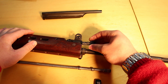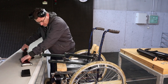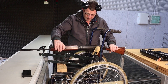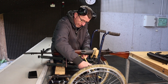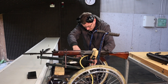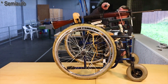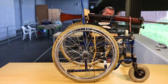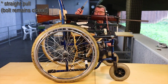The first thing I want to do is measure the velocity at which the gun recoils, in both cases of semi-automatic and manual operation. I asked my friend Guy to help fit the rifle to a rest and tie everything on top of a wheelchair, so that the whole thing can move freely under recoil. This is of course not a properly scientific experiment, but it's going to work for our purposes. I'm writing the calculated final recoil velocities of the whole contraption on screen. I haven't yet done the numbers, but I already know that they are going to be very similar, and any difference is only due to experimental inconsistencies.